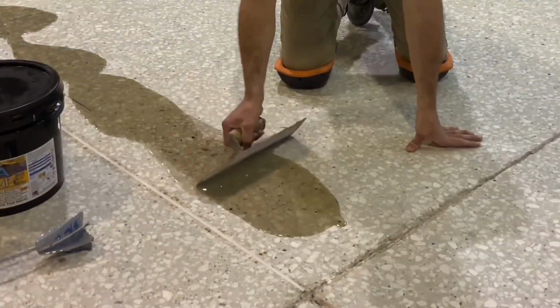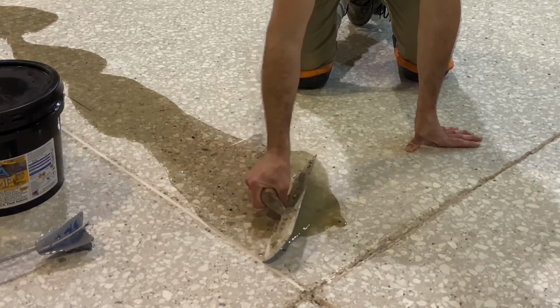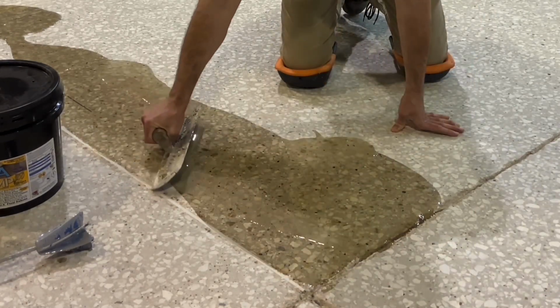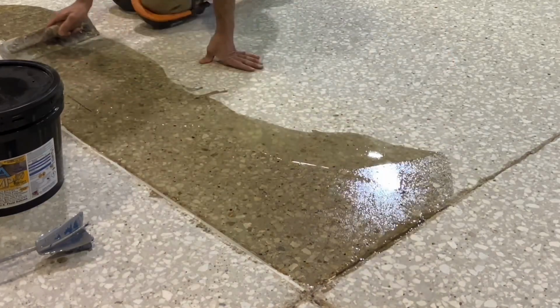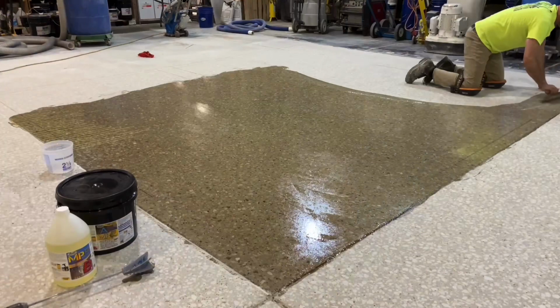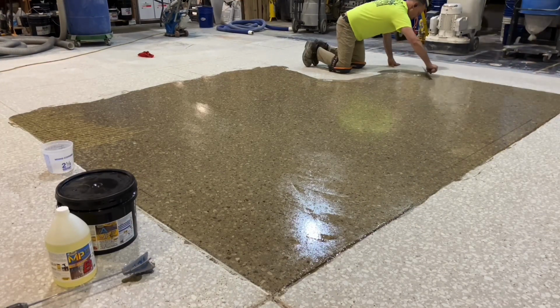The epoxy is applied and spread by trowel. The aim is to completely fill the surface pits, but leave as little behind as possible. The holes are large enough to reflect through the flake and also swallow some of the pigmented body coat. This skim coat makes the slab surface absorbency uniform.